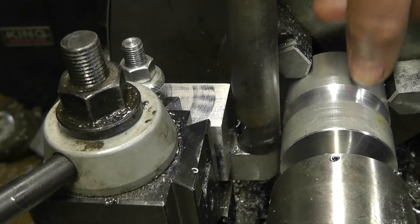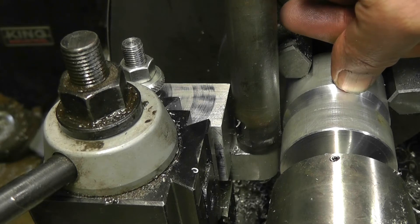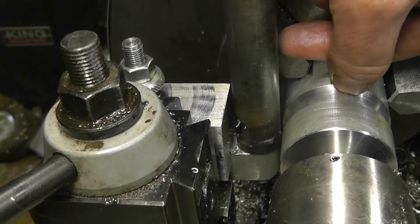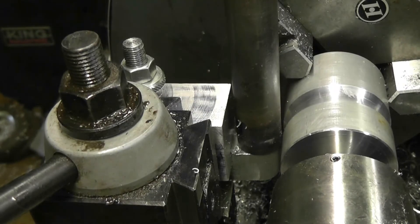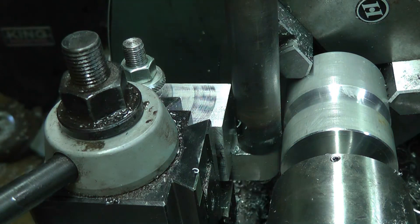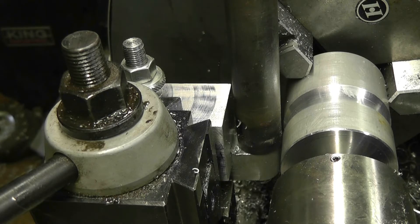Okay, so the stuff is stringing up a fair bit, but it did a pretty good cut. You can see right there where my thumbnail is — there's a little graze mark, and I think what happened is one of these little stringy bits got caught between the work and the tool bit. But nevertheless, this has been a lot less hassle and a lot less frustrating than the previous version. So I'm going to do a couple more passes and see how that goes.